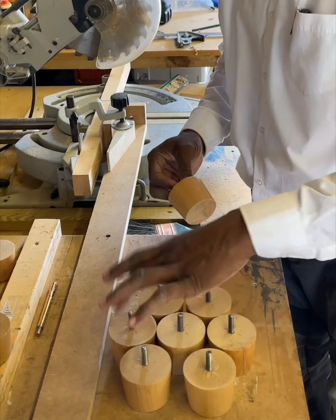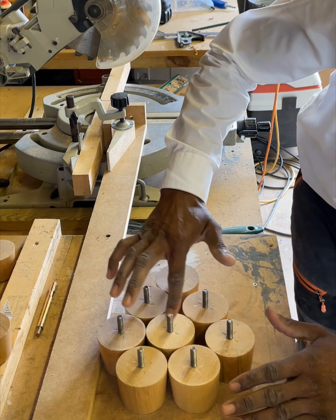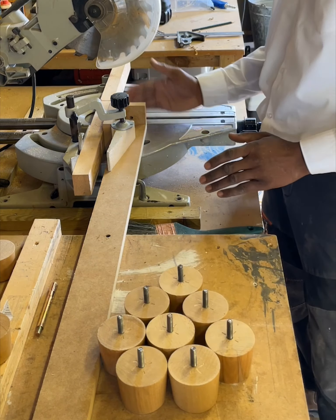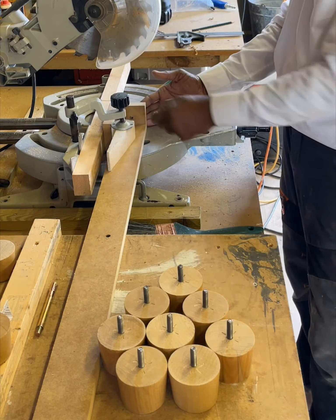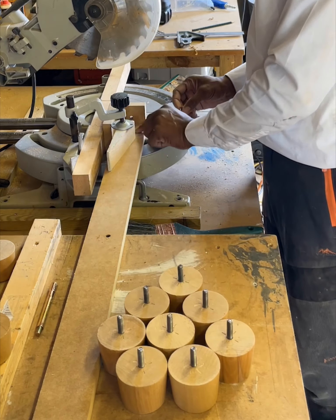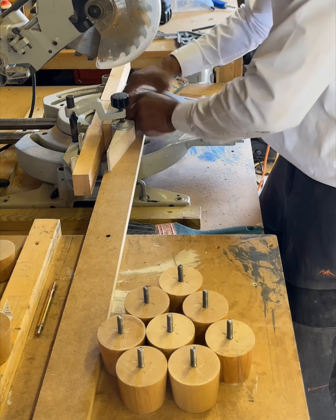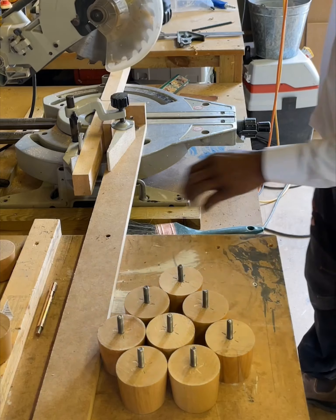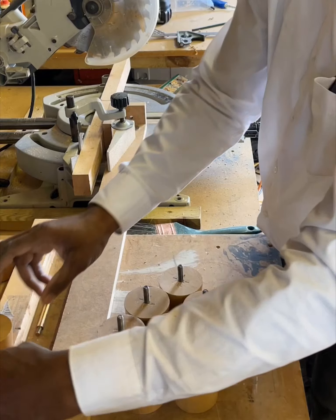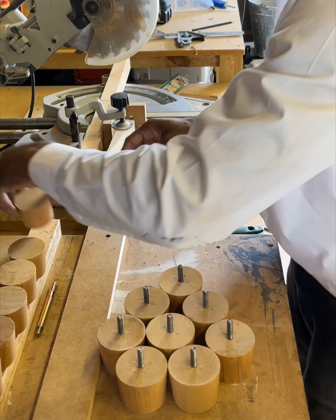Two, four, six, eight legs — all cut to size, all exactly the same height, no variation. All because I made myself a nice little jig. I screwed them flat, locked them in place with a nut I had lying around. I used a washer so the nut didn't bind and bite into the MDF, tightened it all up, plunge cut — making sure the jig was locked in place — plunge cut all my off-cuts, same size.